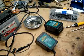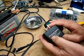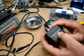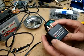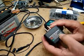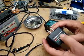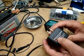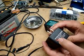And then they quit. The problem I had was one of two things. When you plug it in, it's supposed to flash. With no battery charging, it flashes red with a slow blink. Once you plug the battery in and it starts charging, it should go solid red. When you're at 80%, it should slow blink green, and then solid green once the battery is fully charged. Well, mine would not recognize the battery, even though the battery was plugged in, it would still flash red, or on one of them, it would flash a very fast red, faster than the normal pulse.